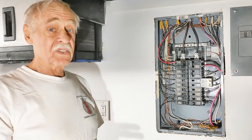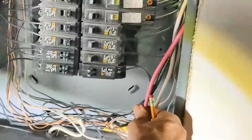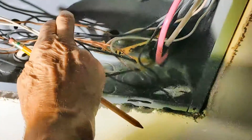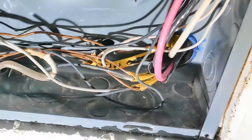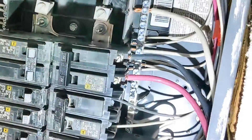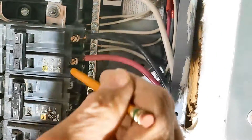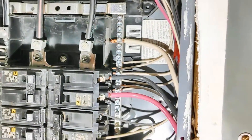The circuit breaker is installed and the wiring is completed. These are the incoming leads from the receptacle — two hot leads, a bare copper wire to the ground bus, and a white neutral that goes to the neutral bus, even though the charger doesn't really use it. The two hot leads pick up 120 volts on each side and combine to 240 volts. That's really all there is to the breaker — it's a 50-amp breaker.